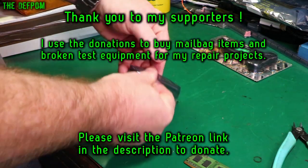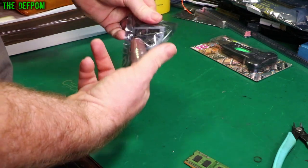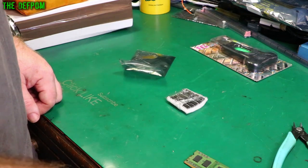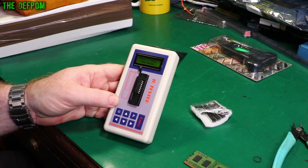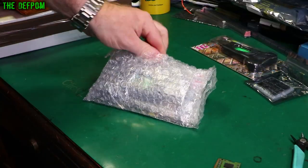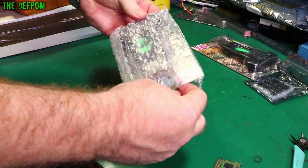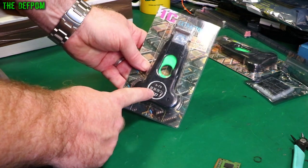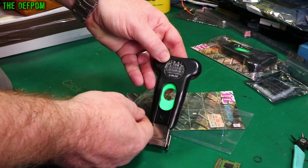Some ICs - I bet these are something like 7406s. Actually they're 74LS279N. But are they real? Unfortunately my chip tester can't find it, so I don't know - either it's fake or it's not in the database. This other package looks suspiciously similar. This is the GJ6, which I showed you before, doing 24 through to 40 pin devices.